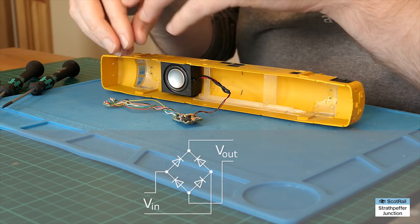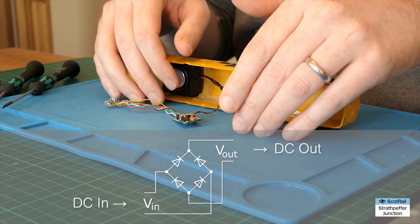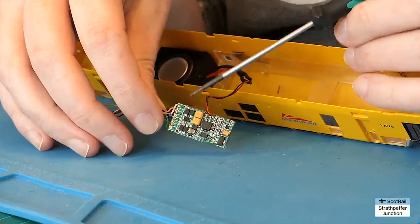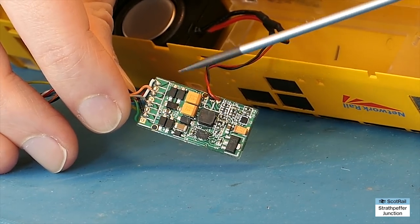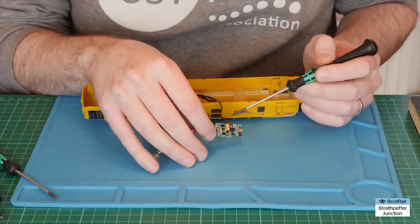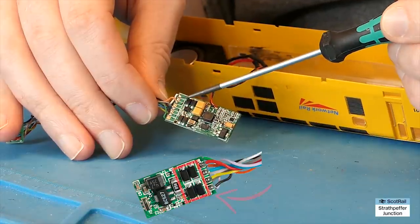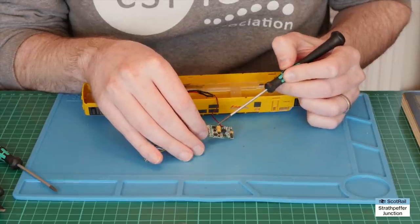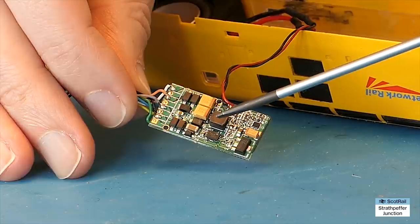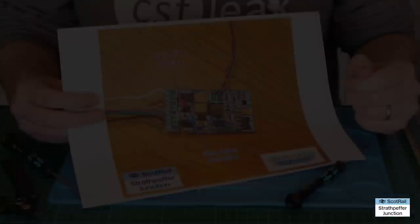What we want to do is connect the capacitor — the stay alive unit — into the bridge rectifier on the chip. The bridge rectifier takes the alternating current and makes it into DC, and with a DC feed it ensures the polarity is always the same. On these particular chips you can see the bridge rectifier is the four diodes here. On all TTS chips I've seen they're absolutely identical, so that is where it will be on yours. You'll also see four diodes on Hornby's basic non-TTS decoder — again that's a rectifier. We need to find out which is the common positive and which is the negative.